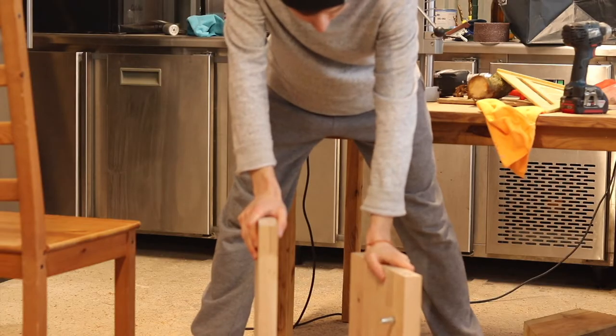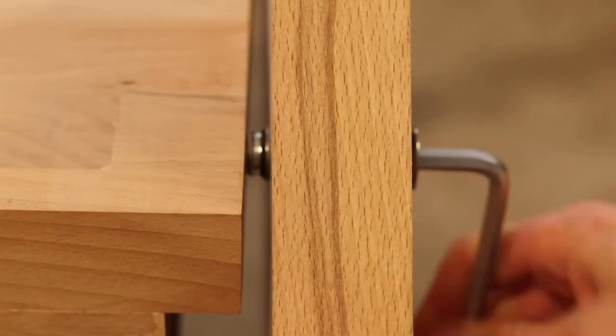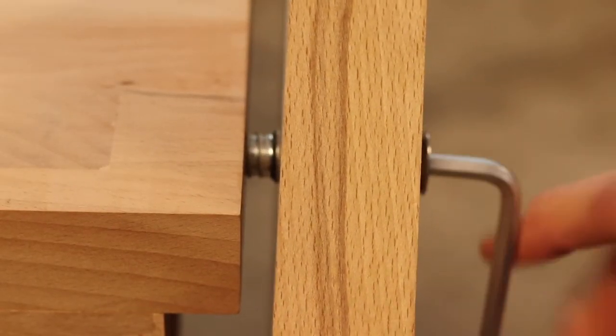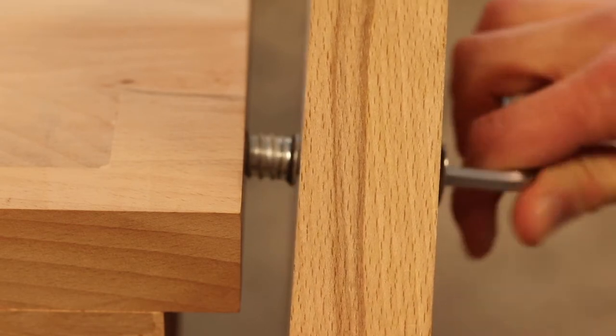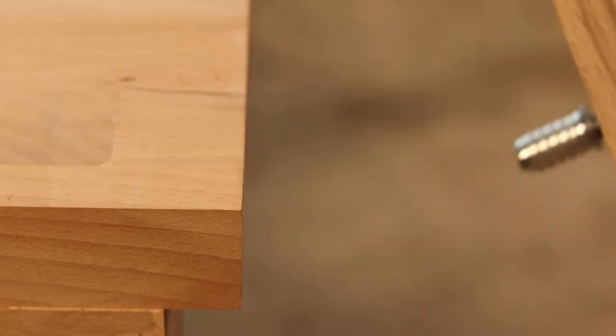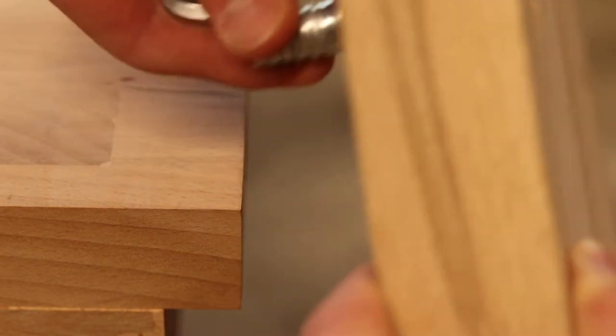Now it's a new day, and it may be hard to tell, but I'm actually very excited to take on a new challenge. This is the main issue. With the misaligned holes, the screws were going into the inserts at an angle, and then they would get jammed into the inserts, so when I tried to screw them out, the screws didn't come out, they would just pull the inserts out.